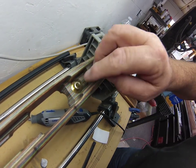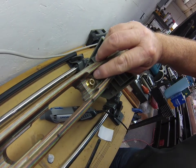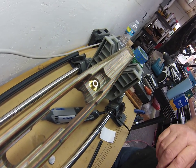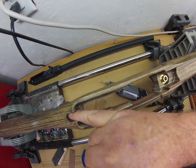Doesn't really have to have it, but they do provide a very tight mechanical lock. So what you'll see when this is done is you'll see the pillar, this part of it, up to here, all the way around, across here and back, that's all going to be bedded to the tang of the receiver. And then of course in the back, that mechanical lock is achieved with this undercut back here.